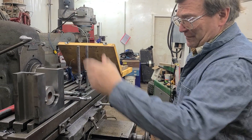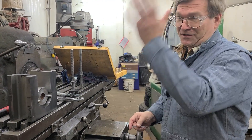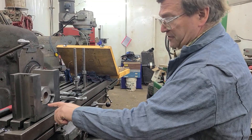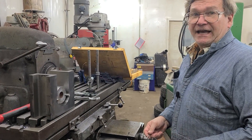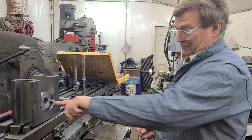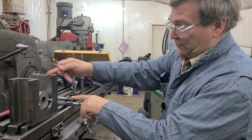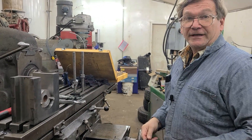The plug, which I will measure when we're all done, I think it was three inch and one thousandth — I just turned it down to approximately three inch. The design spec for this is a three and seven-eighths inch diameter, but if it's off, it's off, and we milled it with the long carbide end mill. I also need to measure both sides when I get there, so if there's a taper, I can work with it.